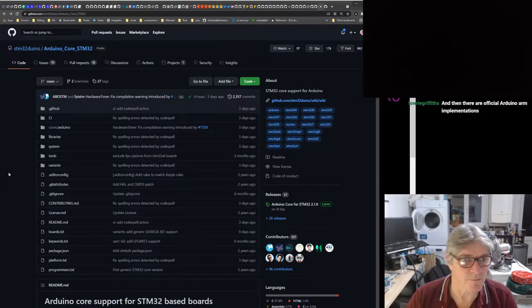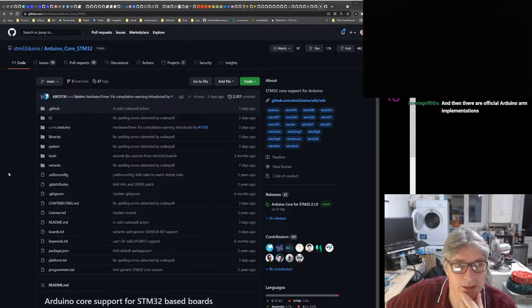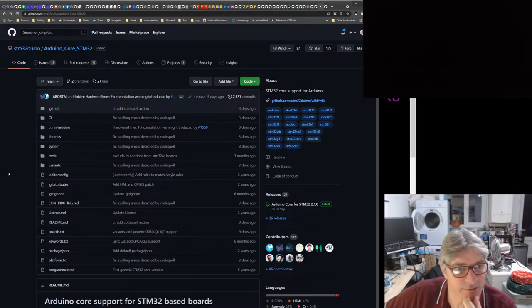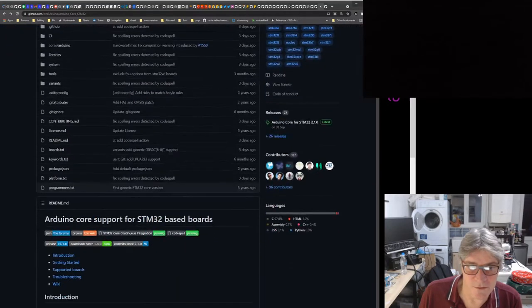So again, you know, I've got most of the C++ code done to do the programming and stuff. I think that'd be fairly trivial to port to the Arduino framework, and then we could also take what Richard has done with the Quad SPI and port that for the STM32 F7 version. But the hardest bit is probably getting the STM32 F7 730, which is the chip that we're using both on the Black Ice MX and also on the Ice Logic deck, because that's not currently on this list, although the other F7s are.